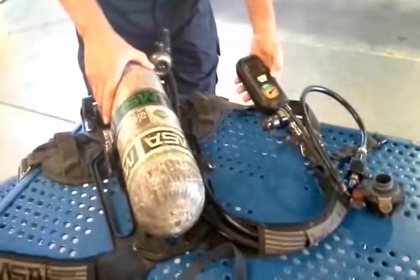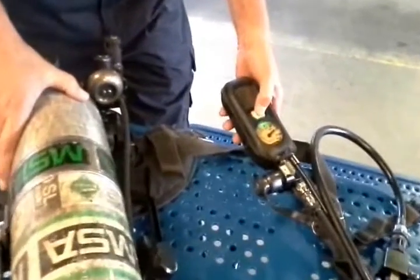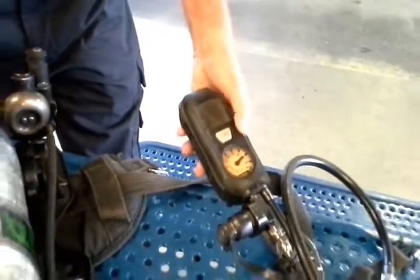Depress the manual emergency button. It must go straight to the emergency alarm and it may not be shaken off. It must be manually turned off by depressing the yellow button on the side twice.